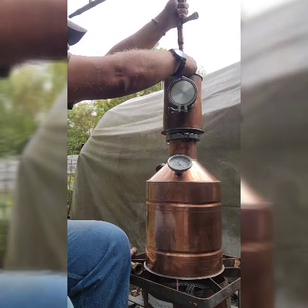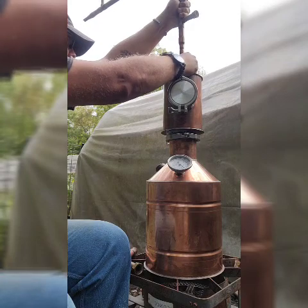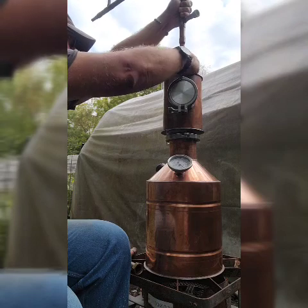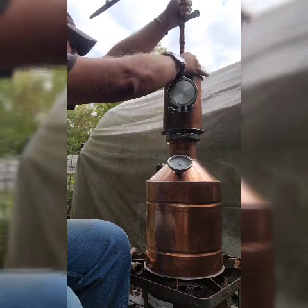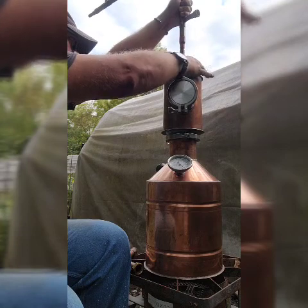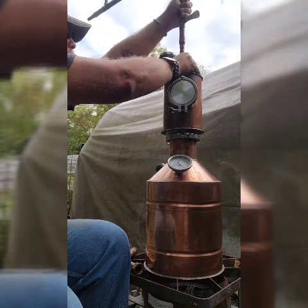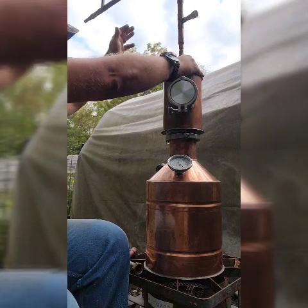And like I said, the next set of these is actually going to have a stainless tri-clover up top as opposed to just a copper top to the head. So that stainless will help reinforce everything and keep it from putting so much pressure on this copper plating up here. But when I run the 45 on this thing, I'm definitely going to be bracing that arm to some degree because it does get a little unwieldy.